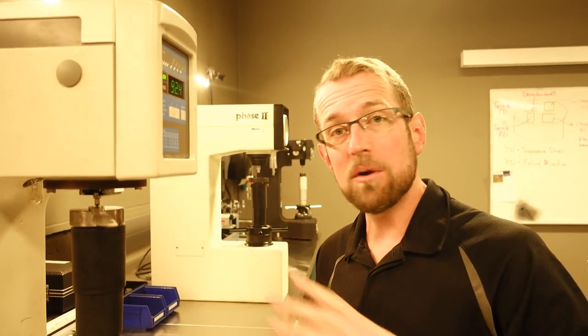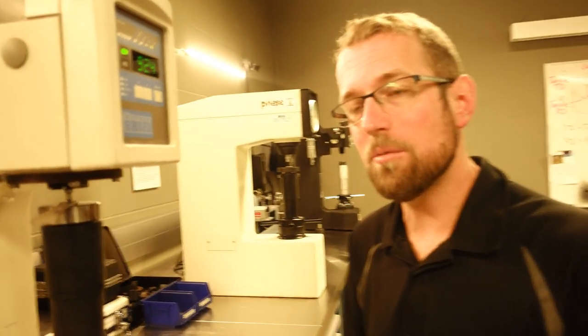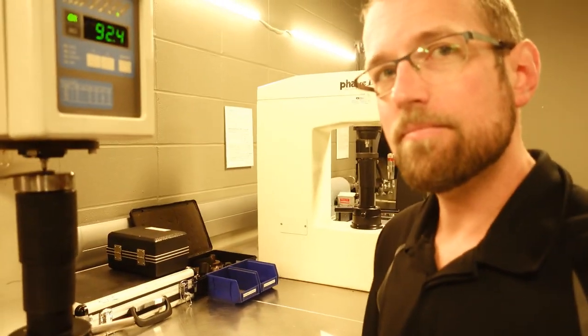In this case, ferritic stainless steel is the same no matter what temperature we hold it at. Increasing the temperature didn't actually change our structure, and so quenching it didn't do anything. It was already the structure it wanted to be. Okay, so you mean there's a transition for carbon steel at certain temperature.